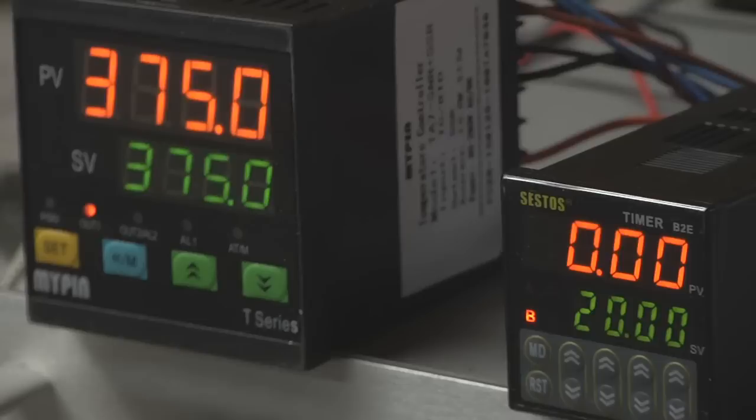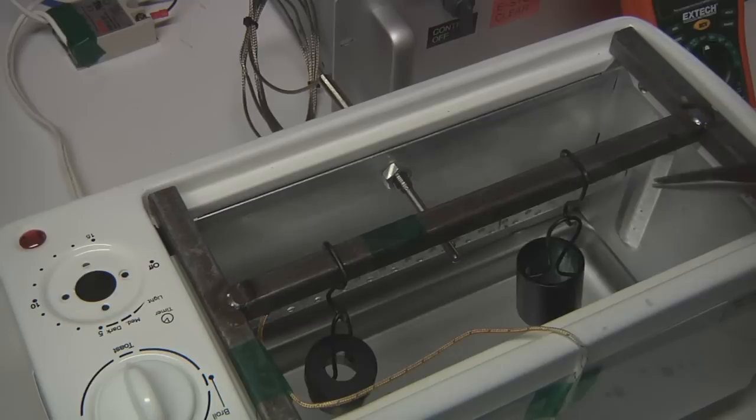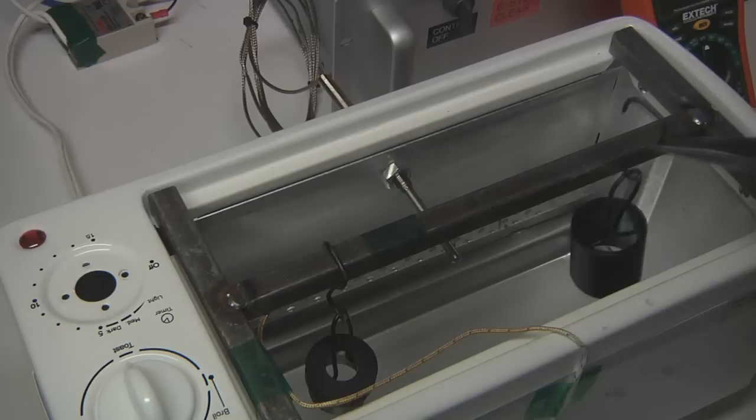And we're done. So we can pull these parts out of the oven. Just like when these parts went in, as we take them out, we have to be very careful with them because the finish is still a little bit tacky. So you can see them hanging down in there. Got their nice little texture coating. Carefully, I'm going to lift them out.